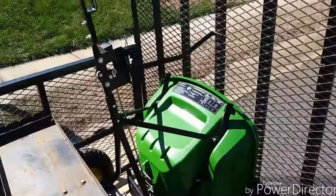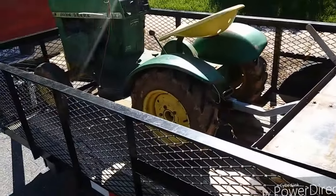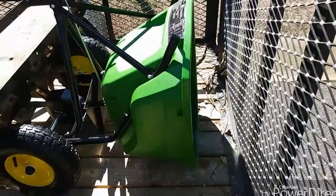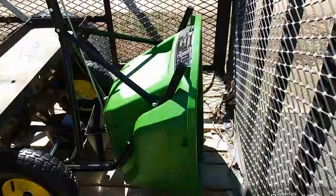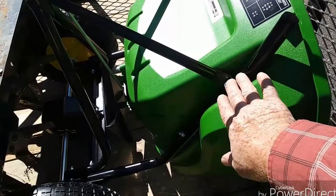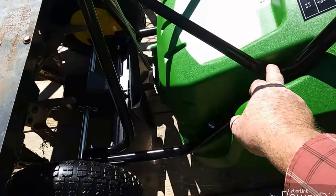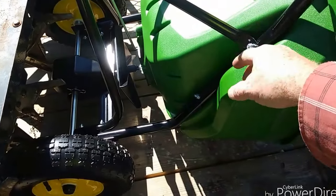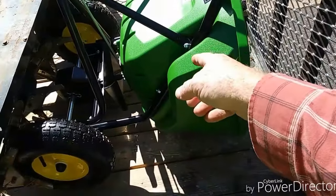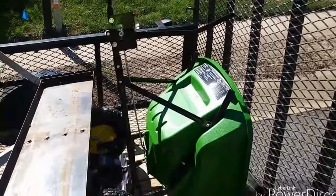Here's the 130 John Deere spreader loaded up on the back of the trailer, getting ready to throw a little aeration seed fertilizer down. After we're done doing that, I'll give you a review on it. Only problem I had with the assembly was it tells you to bolt the hopper onto the bar and then come back and bolt these braces on — I didn't like that. Instead of taking it apart, just leave these two bolts out at the top, bolt the ones at the bottom back, then put your cross braces on. All right, let's get ready to use this thing.